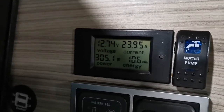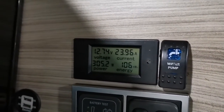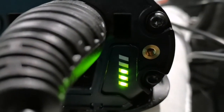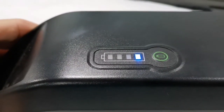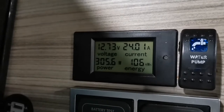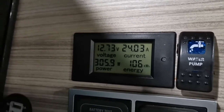So it's going to chew quite a lot of power. Anyone thinking you can do this off-grid day in, day out without solar or something to charge your battery — it's an absolute no-no. You can hear the inverter fan running, batteries are charging and seem happy enough. To reiterate, we are pulling 24 amps and 305.7 watts out of a 1280-watt battery.